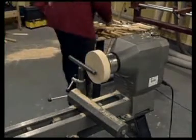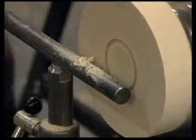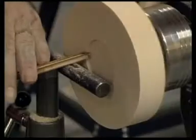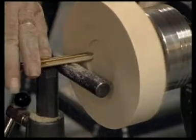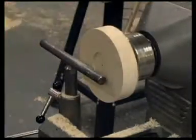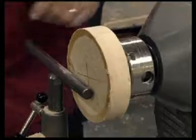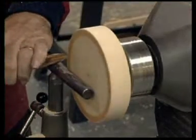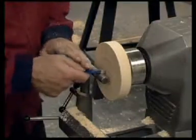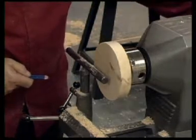In preparation for mounting in a chuck, make a spigot or recess. Next, mark the centre. We will see the importance of this a little later on. Remove the faceplate ring and remount the wood on the spigot or recess. True up the second face and mark its centre. It is important that both faces are flat and parallel for the Steb centres to turn the wood accurately.